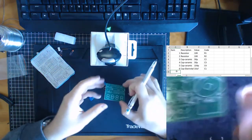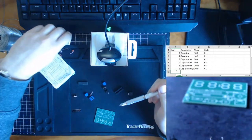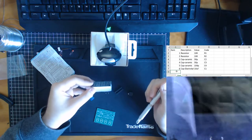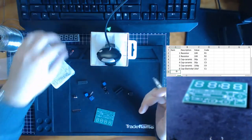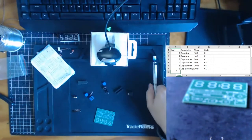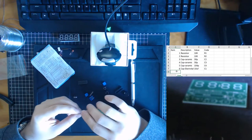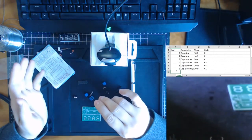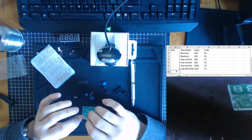So when we have this over here, we already said this is a bunch of LED lights. This component over here is a bunch of LED lights. And we know that LED lights need some sort of resistance in order to reduce the current so that it doesn't destroy itself. So it needs like seven or so resistors, because you need one for each different segment on the seven segment display. So you'd need seven 1K resistors.